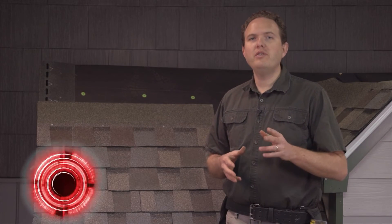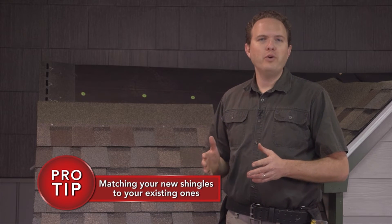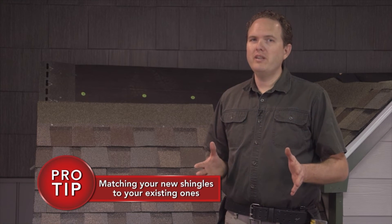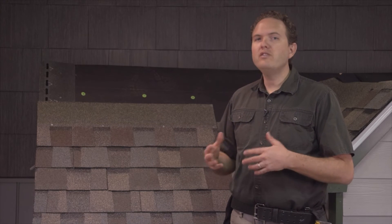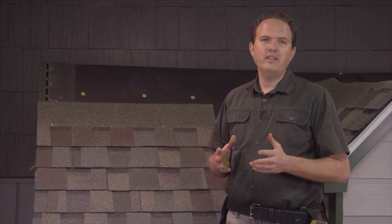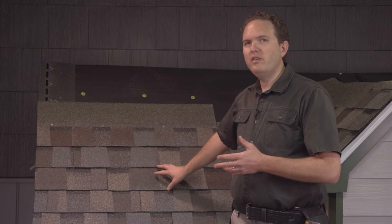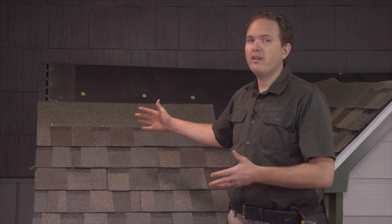Here's a tip from a pro on matching your new shingles with the existing shingles. If the roof you're working on is more than a few years old, your new shingles aren't going to match perfectly — that's just the way it is. Even if you saved some of the original shingles from installation, they won't match because the sun will have bleached out the shingles on the roof. If the replacement is in a very conspicuous area and you don't have too many shingles to replace, one idea is to take shingles off the back of the roof where a replacement won't be noticed, use those on the front, and place the new shingles on the back where they're less visible.